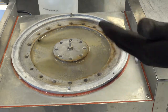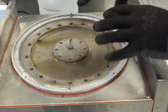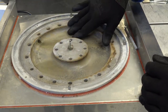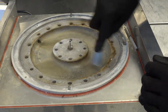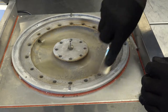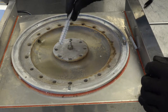After six to eight hours or overnight, remove the excess vinegar using a cloth or napkins to absorb it. With the vinegar or deliming solution removed, take your wire brush and remove any remaining residue. Then use the tubular brush to clean all the ports.